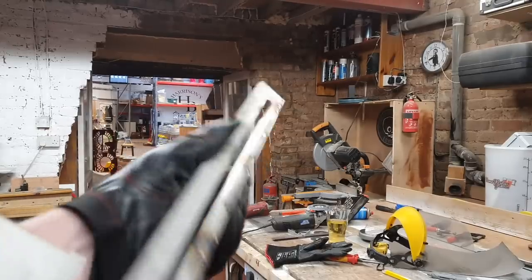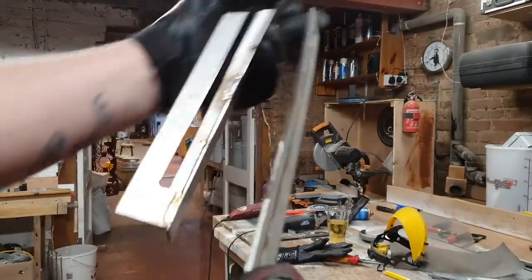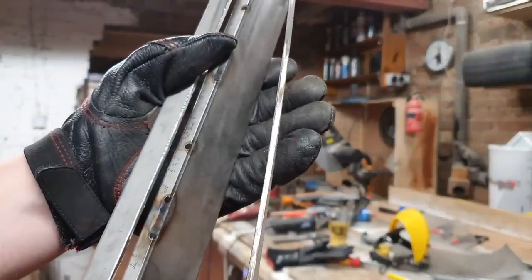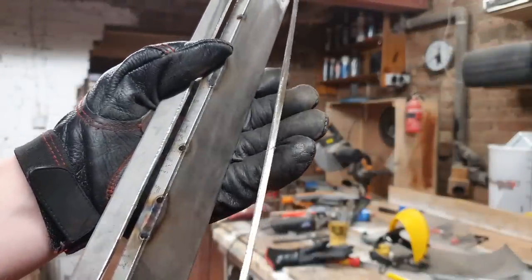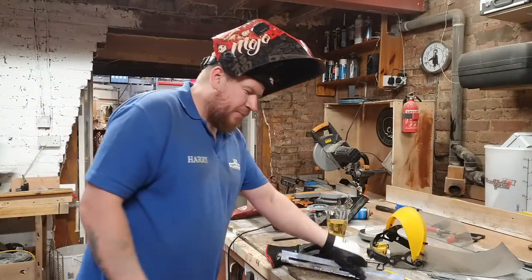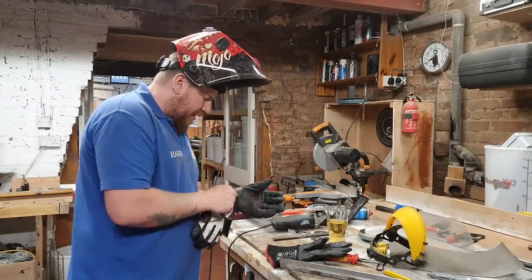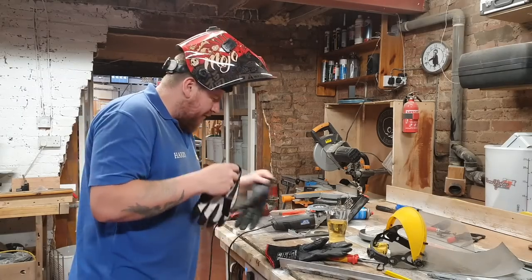And the reason we do that is because then it doesn't move, because stainless steel, where you can see, if you look down at the angle on there, look, it's just gone off center because it doesn't like heat. And if you put heat into stainless, God, it moves around more than a Roman or gypsy like.